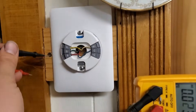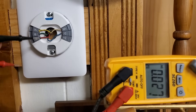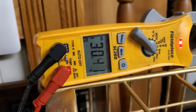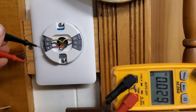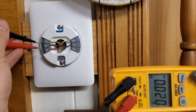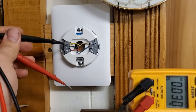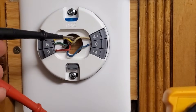We're going to test the voltage now that you understand the basics. The R is going to be our 24 to 30 volts in this case. If we check from the R to the common, you can see we're getting that same 30 volts that we were getting upstairs, which means we have power to the thermostat and it should now be able to function properly. You can also measure power from the R to your other wires as well — 30 volts from R to G. The reason we can sense power from R to G is that there's a relay coil that allows power to pass through to there.